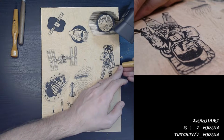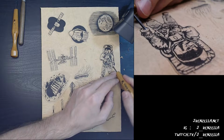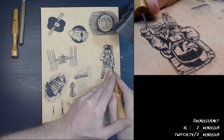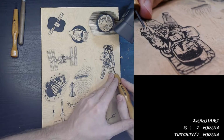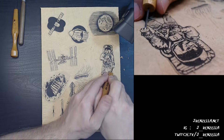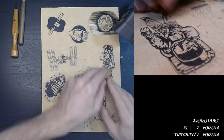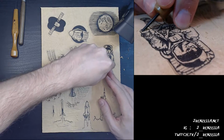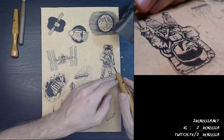Start shallow and push deeper as you go in. And so the tips of the fingers are a little bit narrower. And if you start carving shallower, as the tool pushes into the wood, it will get wider. So the gouge is sort of a U shape, and if you think of the letter U, at the trough of the U is the narrowest part, and as you get higher and higher out of that trough, it gets wider and wider. So it's the same as the carving tool.